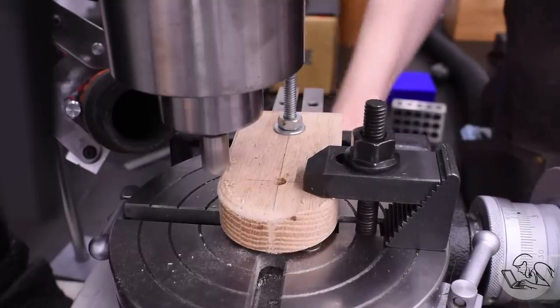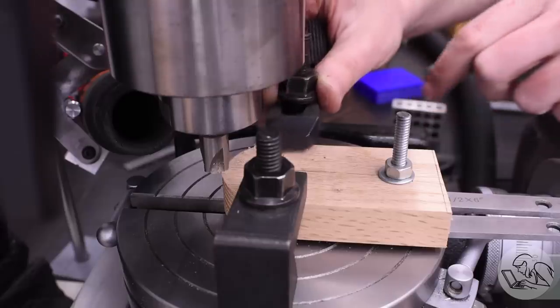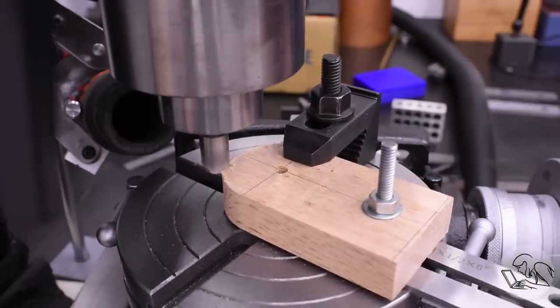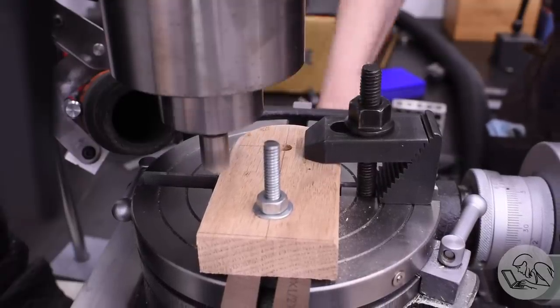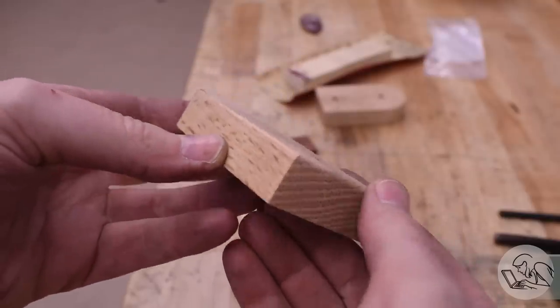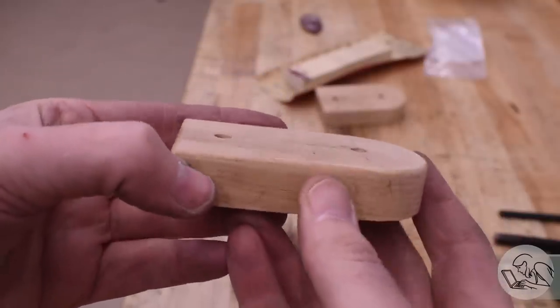If you don't have a cutter like this, I do recommend buying one for this because it was just the perfect tool. It worked extremely well, and I think it saved me a lot of effort. And as you'll see, it results in some really nice looking sheet metal parts in the end. The tube sheet was easy because it was round and I could just file it over on the lathe, but doing these corners for all of these other formers with these complex shapes was going to be a lot of extra work, and the radius wouldn't necessarily be very good.